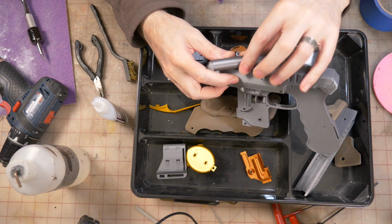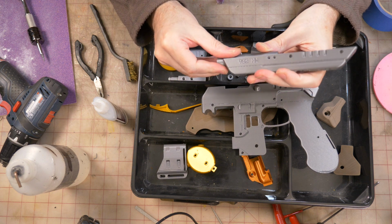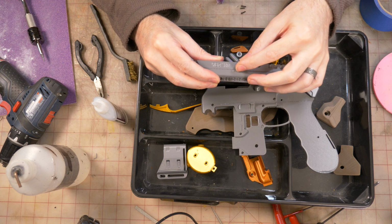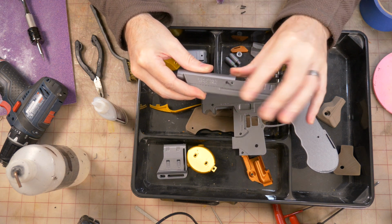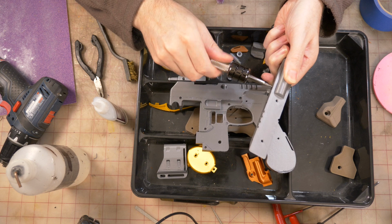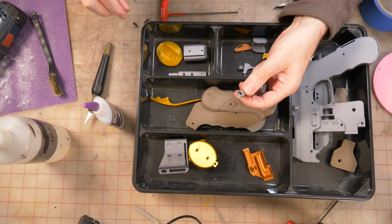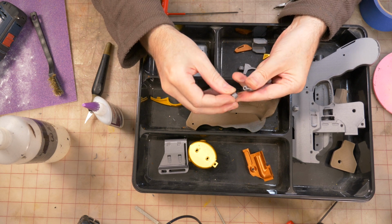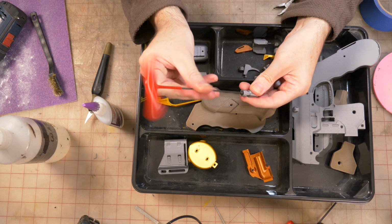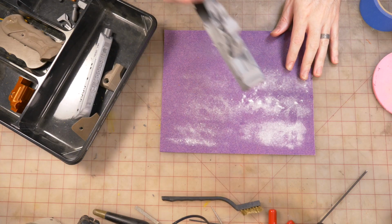Next, we'll screw in our barrel. That goes in here with 4 more of those M2 screws. Like I said, those got shortened just a little bit so that they don't meet in the middle, but they should just be able to pass right through into the holes that we tapped. And there we go. We'll just screw in all 4 of those. Next, we can screw the knobs on the ends of these tubes here. These are just these 10mm M3 screws. They get threaded right into those holes that we tapped earlier. Just like that.